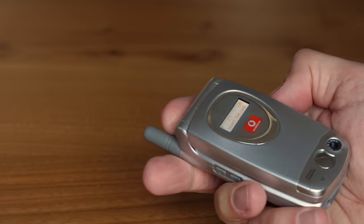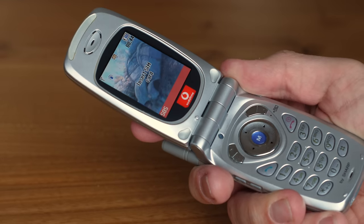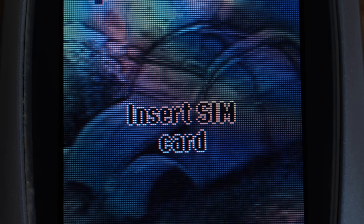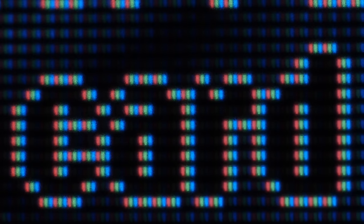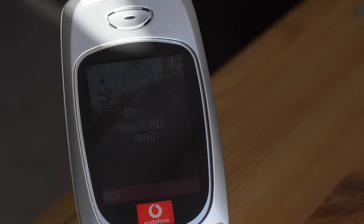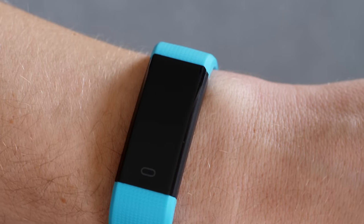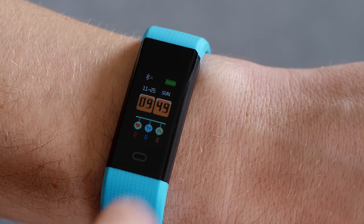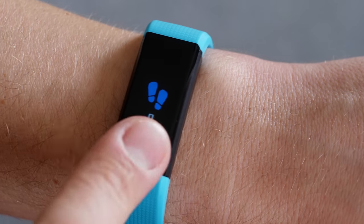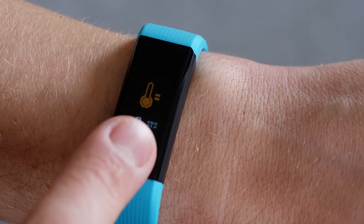And last and least is of course red, green and blue subpixels. There's red, there's green, there's blue. And depending on the brightness you get any color you want. This display is interesting because it's reflective as well. Too bad this is not done anymore due to the contrast battle. The production costs of color displays have dropped so much that you can get your own smartwatch for only a couple of dollars, literally.